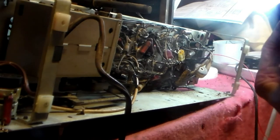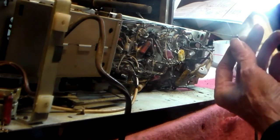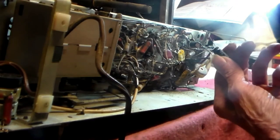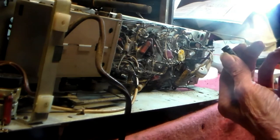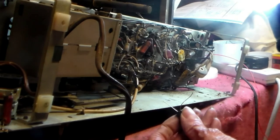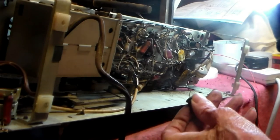There's one here, you see, you can't see it to look at, you see? Put them in the right way around. Otherwise, things can happen like big bangs. There's one cap in this electrolytic, which I might or might not change, I don't know yet, on the VHF side, that goes again to ground. Most of them, the negative goes to chassis.